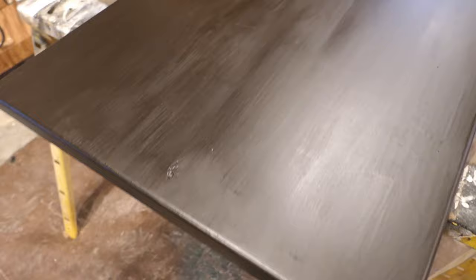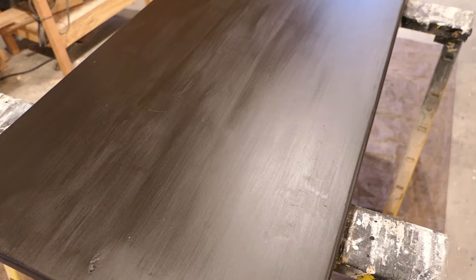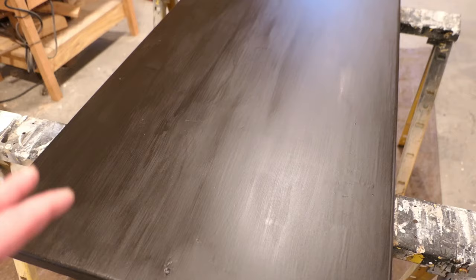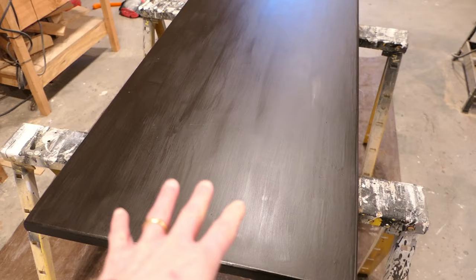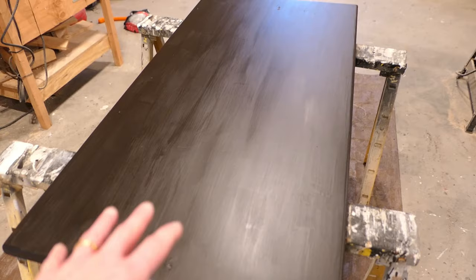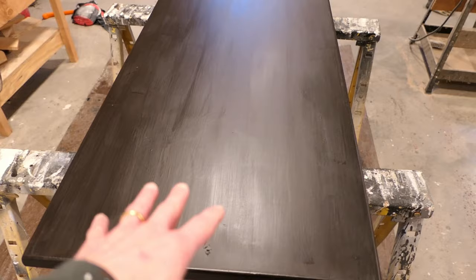I let that dry overnight and, as luck would have it, I don't think I'll need a second coat — this looks pretty good as far as coverage and color. There are imperfections like here and here, but that's all in the wood, not from the stain or glaze. Now the next question is the clear coat over this. I'm going to leave it a little longer to make absolutely certain all the petroleum products have evaporated, because I'm going to be covering this with a water-based polyurethane. There are also different streaks of sheen — some shinier parts and some less shiny — but that's okay; we'll take care of that with the final clear coat. The sheen you see ultimately depends on the clear coat, not necessarily the color underneath.